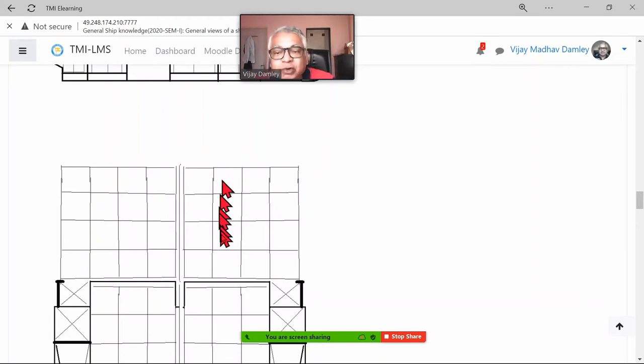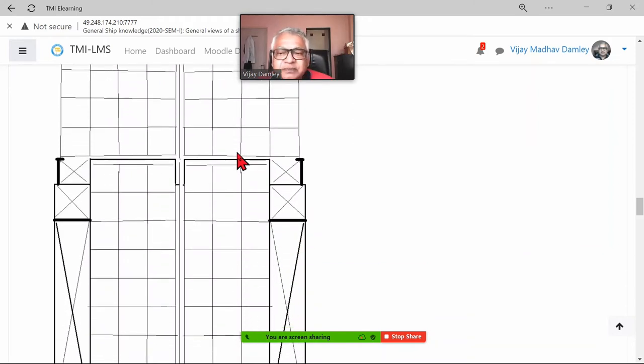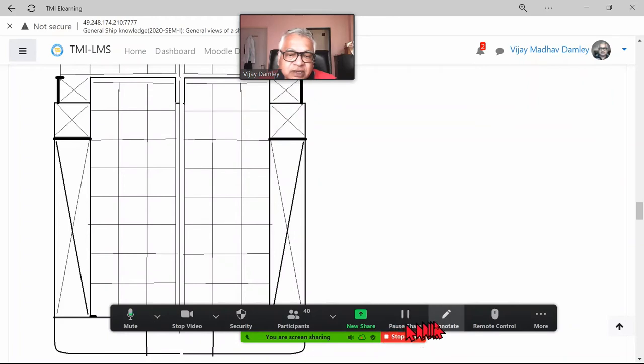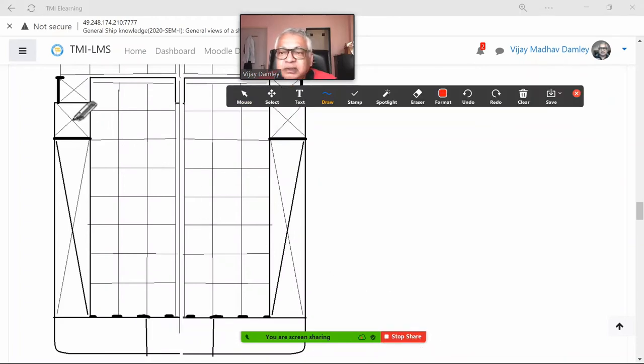And then you load. Now, here on deck, you do load 9 high, 10 high also, depending on the ship. Okay? So, it's a huge operation. Huge, simply. But what you must understand is, this is the strength of the container ship. See, here we have got frames to make a stronger part. Then you have got double bottom full of frames.